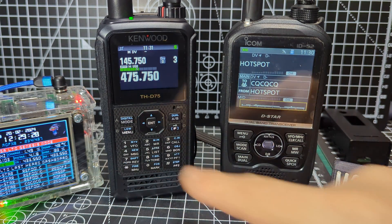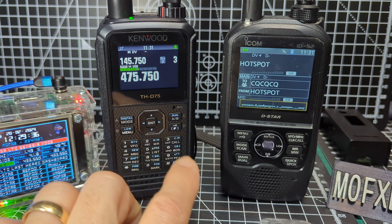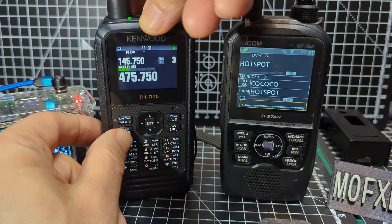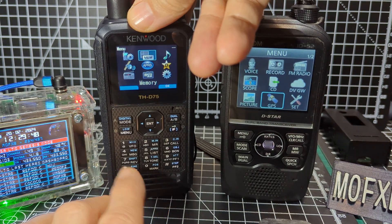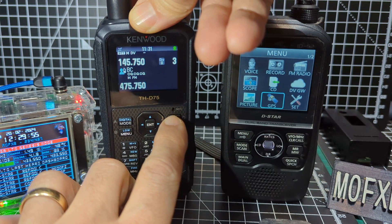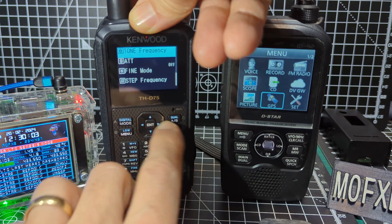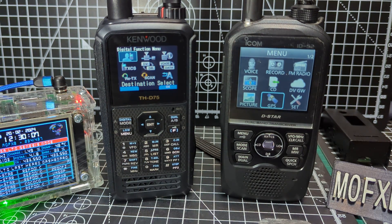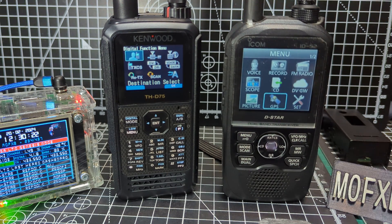They both do DTMF — you've got DTMF keypads. On the Kenwood they've done it so that all the front buttons have a function: tone, tone squelch for your repeaters, shift, and then you've got an F button. They both use a grid menu system. The Kenwood, because it's got so many functions, has a sub-digital menu as well. When you're in digital mode on the A band in VFO, tap digital for DR mode, then go F digital and you get this digital sub-menu. You can program the 75 via Bluetooth — all the programs that work on a USB cable will also work via Bluetooth, which is tremendous. You get excellent free software with both, or you might go for the RT Systems software, which is excellent.